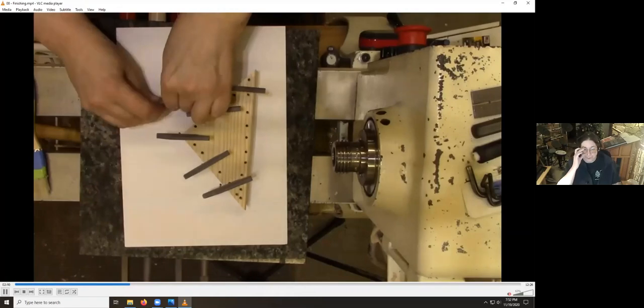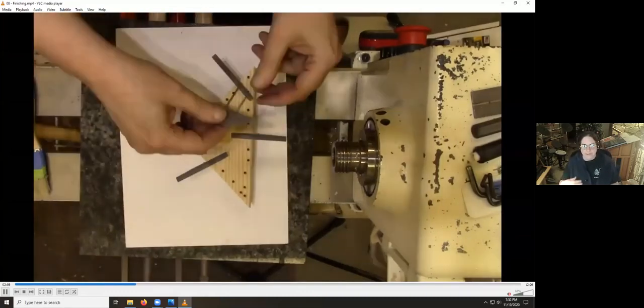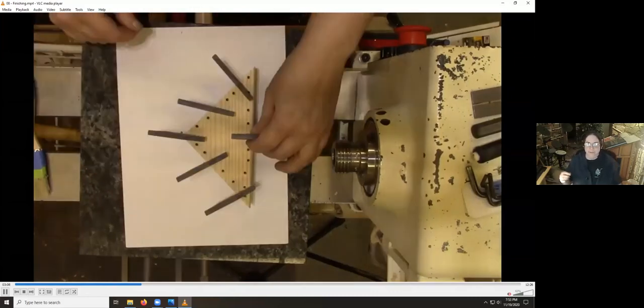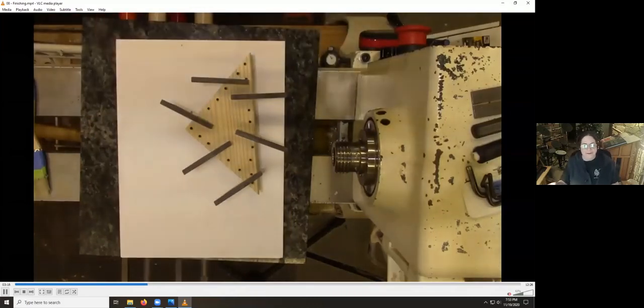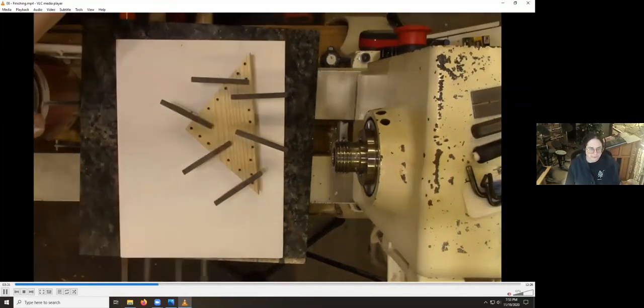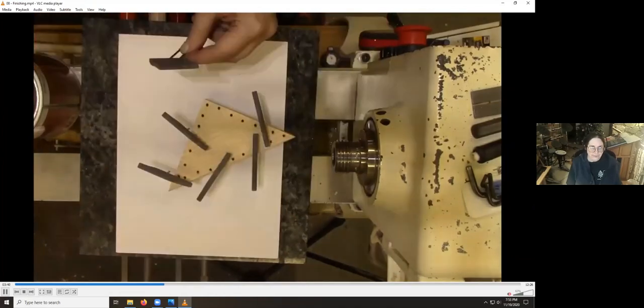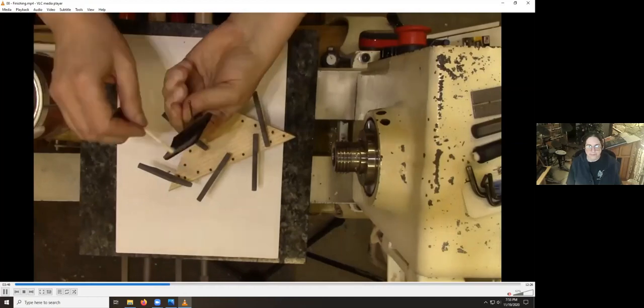The reason I do it this way — if I were doing a sprayed finish I'd assemble everything first and then spray. But I don't have spray equipment, and I don't have an area in my shop I'm willing to spray in. I did this at the end of October and it was too cold for rattle cans. So considering this is a shellac and polyurethane finish: two coats of sanding sealer. I'm using Q-tips to apply the sanding sealer to the fins — being reasonably careful not to get it on the side that's going to get glue, but I can clean it up afterwards with a little sandpaper. I give a very generous first coat because it's going to soak in, then come back with a second coat once dry.